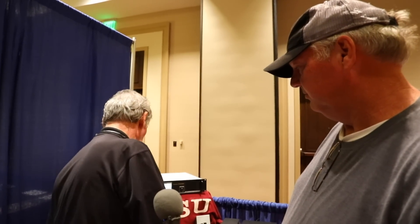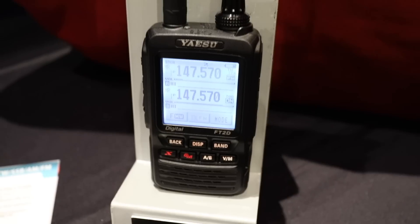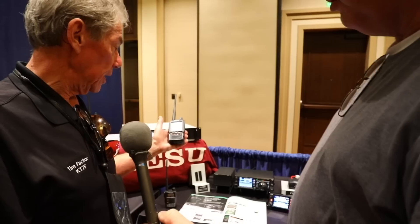The radio in hand is single-band, one band at a time. But they do make a dual-watch version — and now we're getting into more cool factor. This one has a touch screen and it's dual-band, dual-receive, so you can be listening on Wires-X on one band and talking on the other. The model is the FT70D, and anywhere you see the X key on a radio, that radio has the Wires-X function — on HTs and mobiles alike.